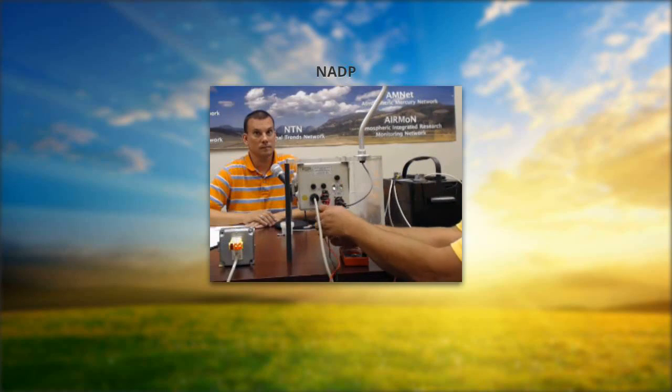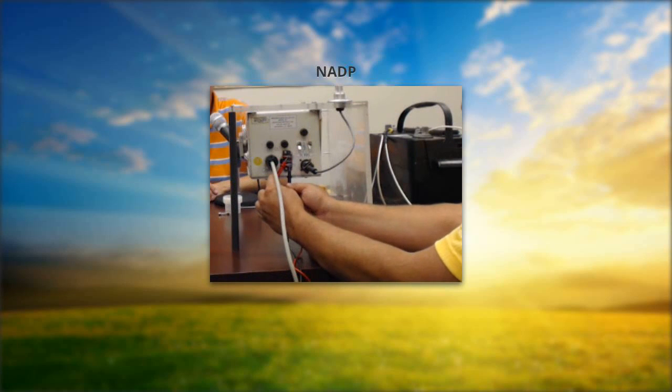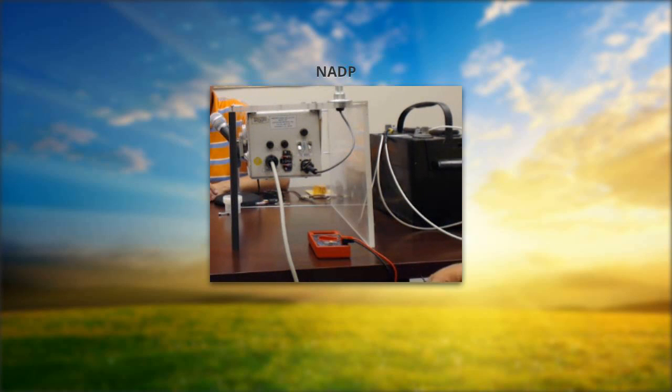Now that we've opened the collector, I'm going to lay my probes on the event recorder — we have 12.37 volts DC coming out of the event recorder terminal. If you had the collector open and still got zero voltage, then as Chris said, we want to make sure our fuse is suitable. The AC fuse and event recorder fuse are both 1-amp; the DC fuse is 2-amp. One of the things every operator should do is pack a to-go package in case there are issues — fuses, notebooks, voltage tester, receptacle tester — so if there are problems, you can troubleshoot without making an unnecessary trip.